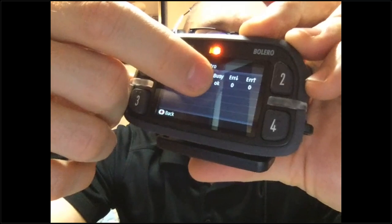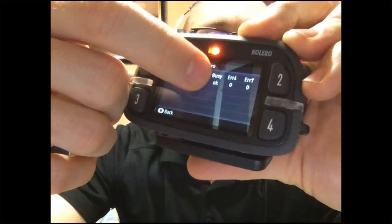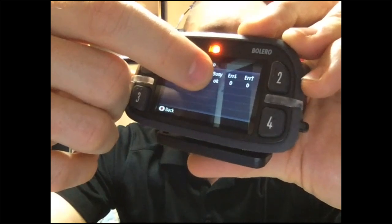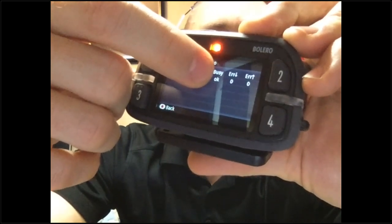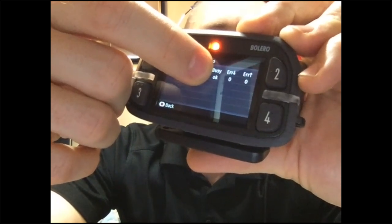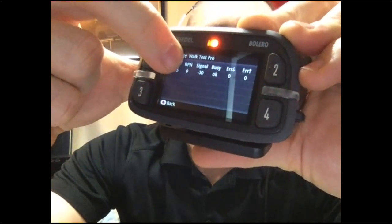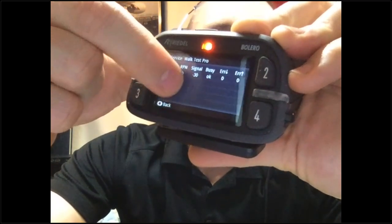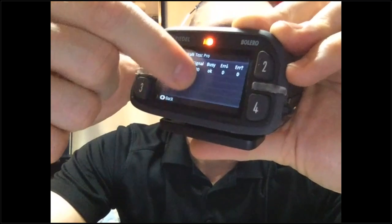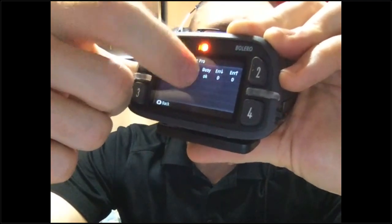And I know that it's okay. When I say okay, I know that there's time slots available. If this said full, I would know that there are 10 belt packs connected to that antenna. Now, I'm not Dave, I'm not cool, I don't have two antennas, but I can tell you there's five lines here for a reason, all right? Because I can read up to five antennas at a time in Walk Test Pro mode.